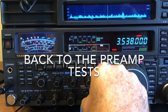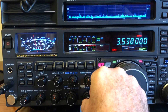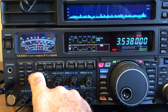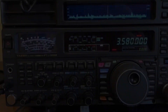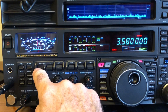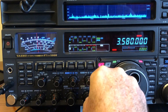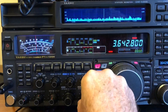Right, I've found an example, but it's actually an AM broadcast station, and this might be just to do with polarisation more than anything. So this is the vertical — and then on the receive antenna, back in the vertical — there's nothing there at all. So there's one example. Here's another broadcast station. Main antenna, then the receive. We have to remember that the loop on the ground is directional as well, depending on where you feed it — either in the corner or down the sides.